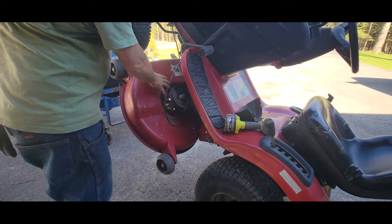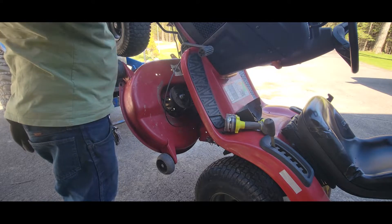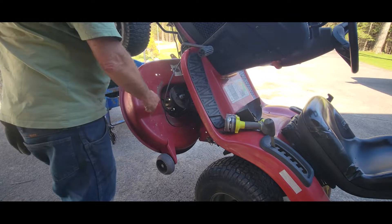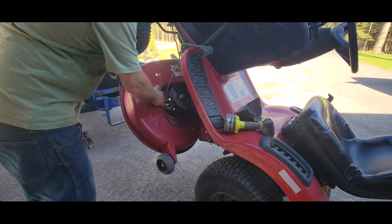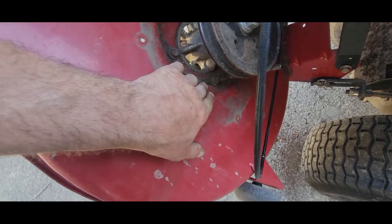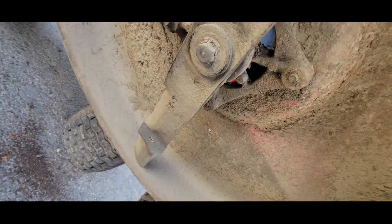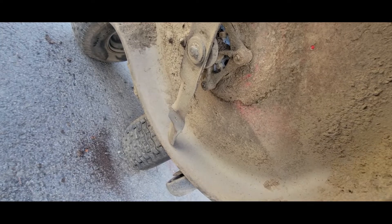I had leaves in there because I use the three-bin bagger. We do an acre and a half here with hundreds of trees on the hedgerows and it gets deep with leaves — you can't even see what's going on and all of a sudden the deck's not running. I'm going to take them out — they look a little crusty. I hate to break them off. They look like 13 millimeter, two of them, going right through the spindle. I could get a propane torch and warm them up — that probably won't hurt anything.